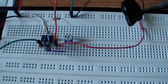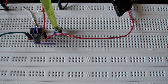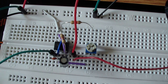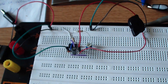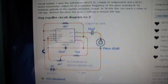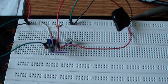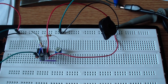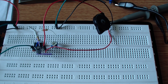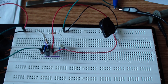I made a small adjustment. Let me stop this noise — I have replaced the 10 nanofarad capacitor and replaced it with a 6.8 nanofarad one. As you can see in the circuit the capacitor has 10 nanofarads, but in my case it didn't cover the whole range up to 22 kilohertz, so I replaced it. Now it covers from 12 kilohertz up to 24 kilohertz, as you saw on the oscilloscope.